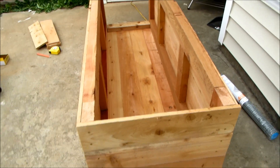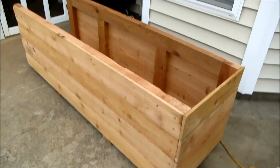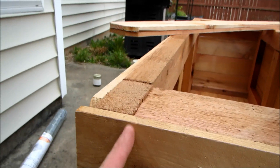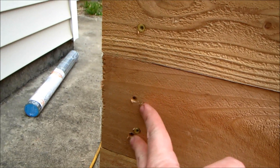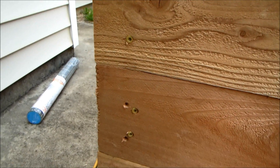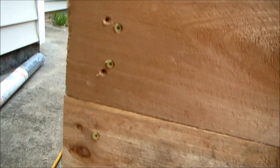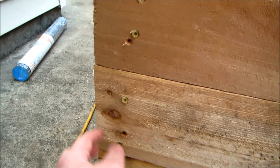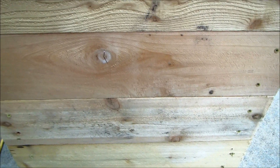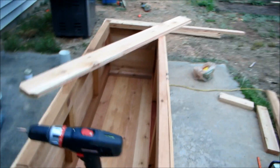We're not building a house here, we're building something for worms, so if you're OCD you might want to use some better tools or better squares. To keep the boards from splitting, you have a two by four line here and you can actually go in on an angle, even farther out than the actual board, to give yourself a good two and a half to three inches. Since these are two-inch screws you're not holding a ton of weight — you can go in on an angle. I had a split, so I just moved it and went back up.